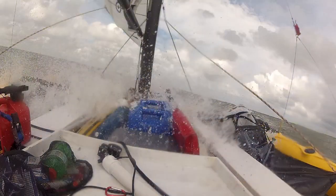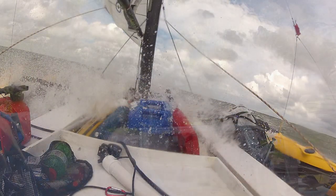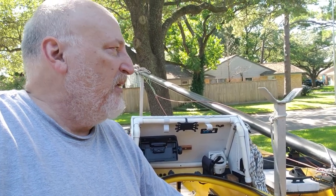On my last run I hit a big storm and had some bilge pump problems. I had the manual standard pump, and it ended up getting leaves and some plumber's putty stuck in it. I was in a big storm getting swamped and the pump clogged up. I had originally put the transducer for the depth finder in the boat held with plumber's putty, a kayak fisherman's trick. Some of it migrated into the pump so it all had to go.